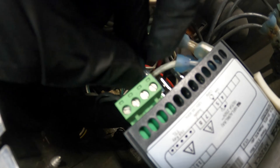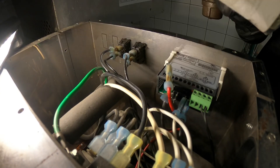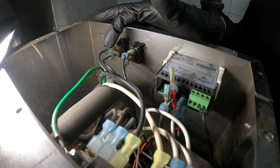Now we're just going to go wire for wire in the same orientation as before. Black with the marking is eight, white is seven — that's hot and neutral most likely. Red goes to five, and black goes to four. But I don't like the condition of these connectors. I have a new pack of solderless connectors that are insulated. This one is darkened and this one already broke off because it got so dry. I'm going to fix these up.